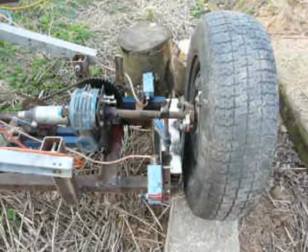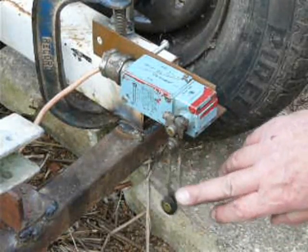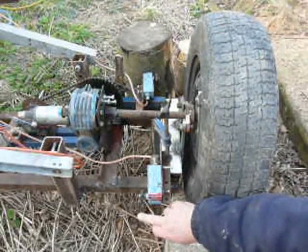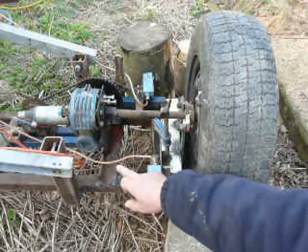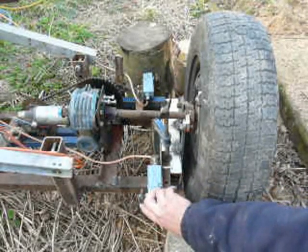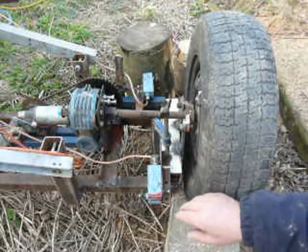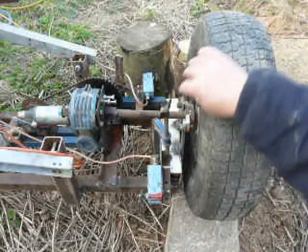There are limit switches fitted, and here's one of them. So when the tracker goes all the way that way, then it comes against the stop and switches off. Now, each of these has got a diode in it as well. So you imagine the diode is set so the positive can run through here — it switches off. When the motor goes the other way round, as soon as this gets away from the stop, it would switch on and the motor would continue. There's a limit switch the other side, but if this was still switched on, that limit switch wouldn't do anything.